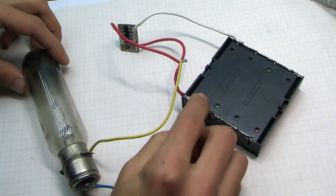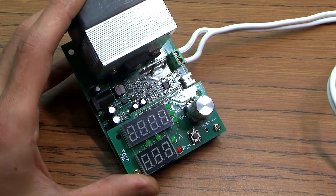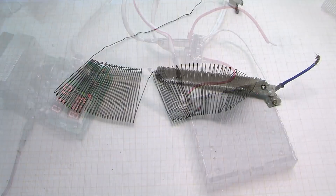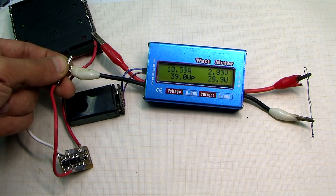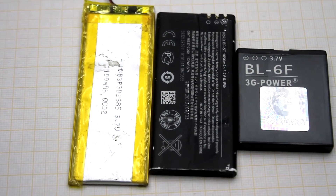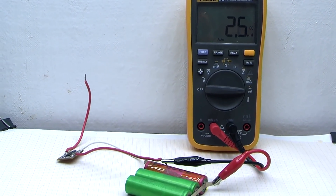The most important is the value of current at which the protection will work. To test this, I took an electronic load — a very cool model; the link will be found in the description. This model allows you to load the battery with a maximum current of 10A, and as we can see, protection did not trip for currents up to 10A. Next, I took a nichrome spiral as a passive load. By gradually reducing the load resistance, it became clear that the protection was triggered at currents of about 12 to 13A — just what I needed. Lithium-ion batteries have a small self-discharge, but a battery supplemented with such a board will discharge faster than a battery without protection. The current consumed by the protection circuit is very small — about 2.5 µA in my case.